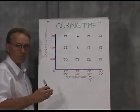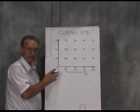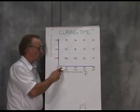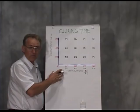One important feature I should mention too, or drawback to resin, is if you have to work outside and you're working in direct sunlight, this chart pretty well doesn't apply because sunlight is like a combination catalyst and promoter, and it will literally probably reduce your working times by about a quarter. So if you had 30 minutes here, you might get 5 or 6 minutes outside in direct sunlight. Anyways, now let's move on to our video on laminating fiberglass.